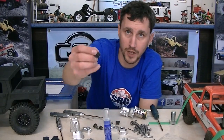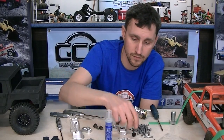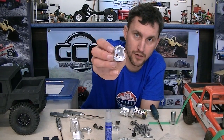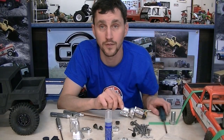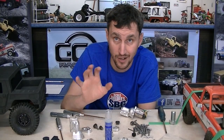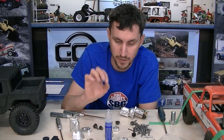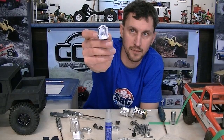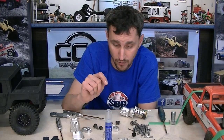Take out the black shaft with the gear on it. Inside the little back cover are two bearings - they might be stuck on the shaft but the two bearings have to get split up. One of them is just a spacer; the other bearing is actually being used as a bearing. The small bearing is going to go back inside and stay in the back of the casing. The big bearing comes out and gets used somewhere else.